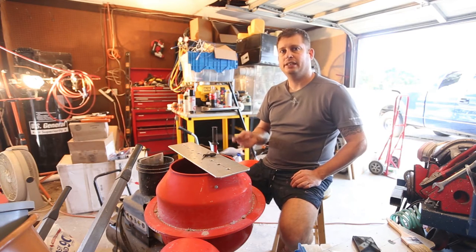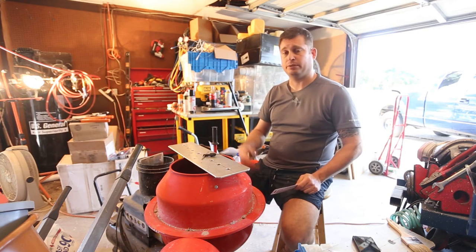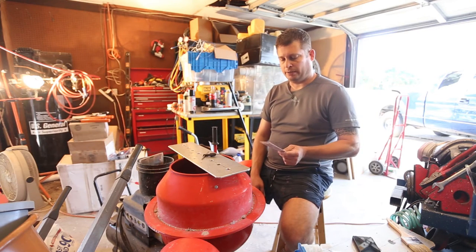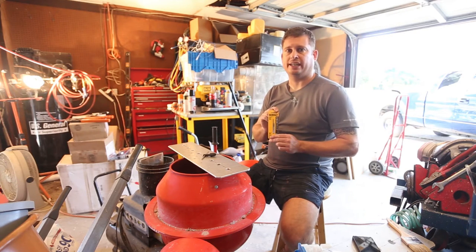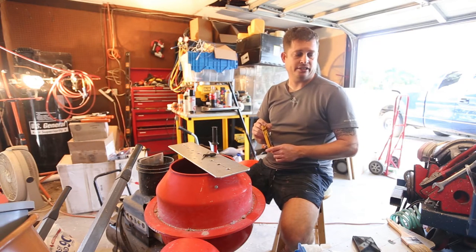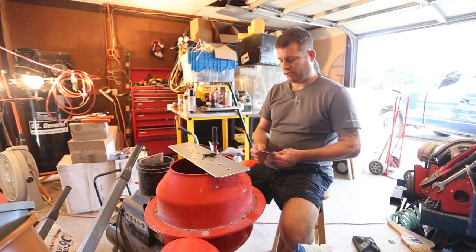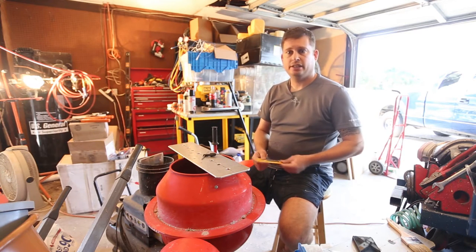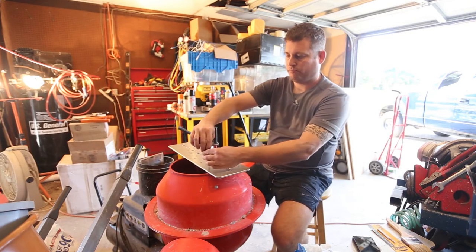Anyway, I'm almost done tapping these by hand. This is a really nice handle and these are good quality taps. Home Depot actually carries these for about $5 per tap, and the handle was about $15. It comes with a number 29 drill, and the drill is good enough that I actually got 32 holes out of it in quarter-inch thick 6061 aluminum — pretty impressive.